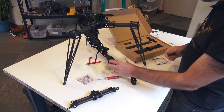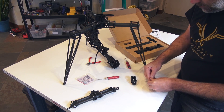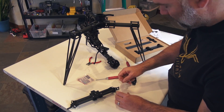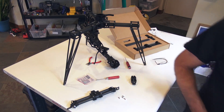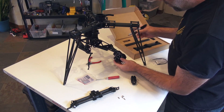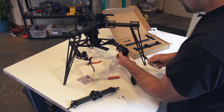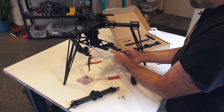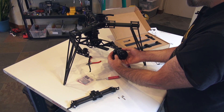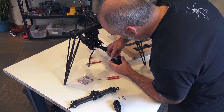That's all complete. Now for this one we're going to use the four bolts that are a little bit longer. One important thing — I'm going to make a mark so I know which side is forward. When I replaced this originally I was having weird interactions. I found out that if you mount this without it being correctly oriented on the shaft — for instance, rotated 90 degrees — that's where the craziness comes from. So we'll make sure to put it back exactly as the original sits.